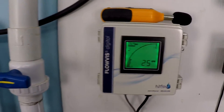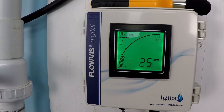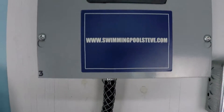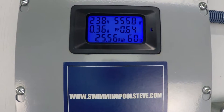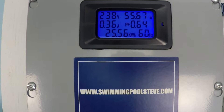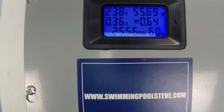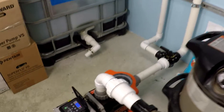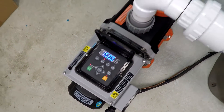At 900 RPM, so low — without a flow meter you wouldn't even know that you're moving any water at all. But as you can see, we're getting 25 gallons per minute, which is pretty impressive when you think about the power consumption. Top right corner: 55 watts — it's less than a 60-watt light bulb. That's how much power this pump is consuming. Variable speed pumps are absolutely the way of the future for swimming pools. 0.36 amps current draw — so a third of an amp.